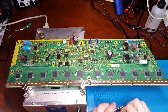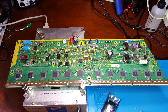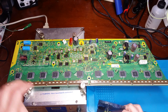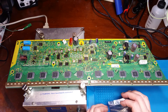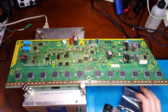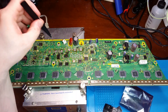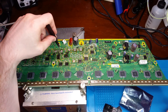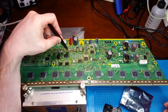This appears to be a common TV with a common problem. There are many kits available — I saw probably three, four, five different sellers selling kits to repair this. But only some of the kits came with the DG302 transistor that I needed. Some kits only included the IGBTs and diodes but didn't include the DG302, though they would include the gate resistors. This kit does not include the gate resistors, but I went through and checked them all and they're all consistent and healthy, so I'm not going to worry about the gate resistors. They're all fine.